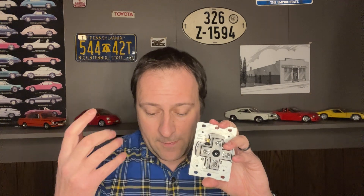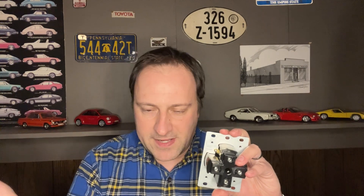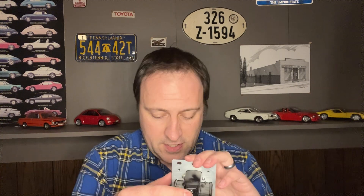There are a number of different companies that make them. This one is Leviton, which is a big company that makes a lot of different outlets and switches — a reputable name. You definitely want to run one of these. I'm not going to give you a step-by-step on how to change your outlet, I'm just going to let you know this is the sort of thing you need to do. One thing to notice is it uses Allen keys, and the packaging actually advises using a torque wrench or torque screwdriver and tightening to 75 pound-inches of torque for each screw.